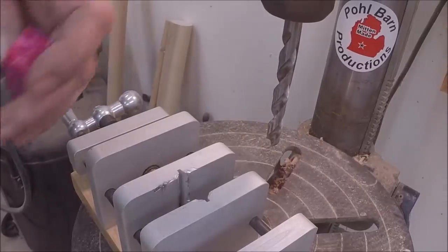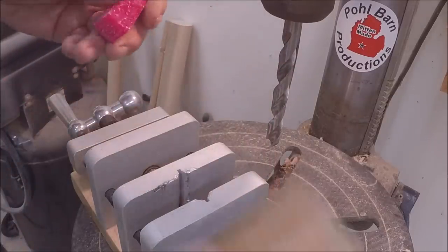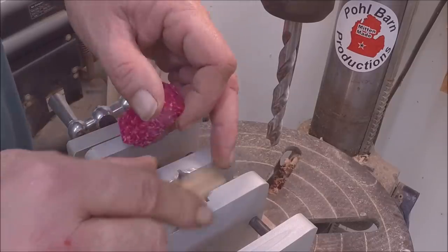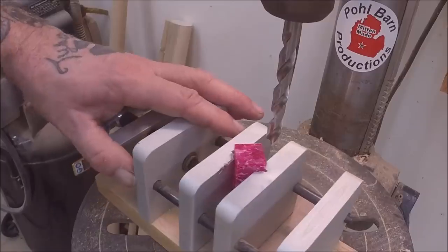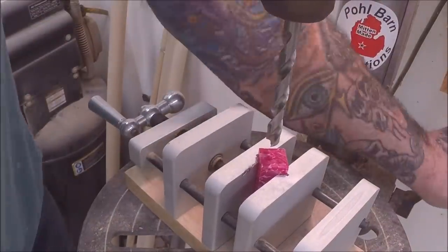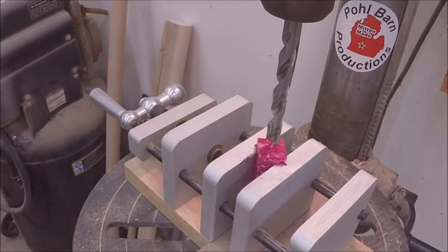So we have a 10 millimeter tube for the top and the 8 millimeter for the bottom. I like to put something underneath it to avoid any chip-out, so I just drop that down in there and tighten her up. Then when we go through it, we go a little bit lower here so we don't get chip-out. I eyeball them and mark center.